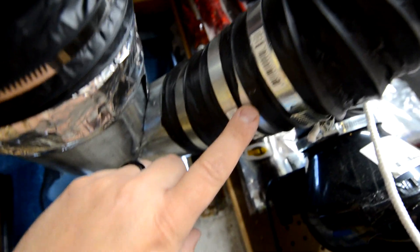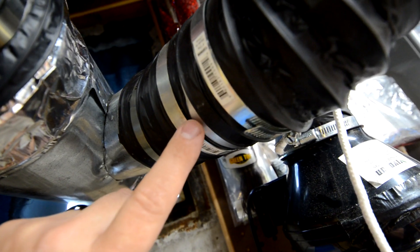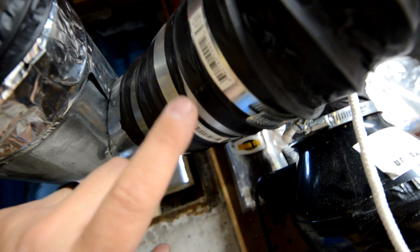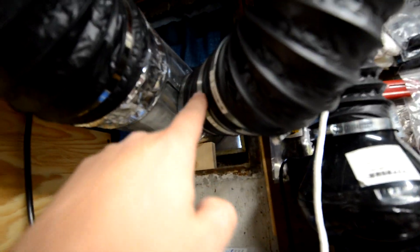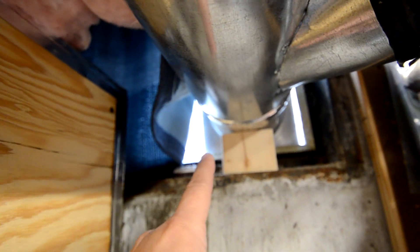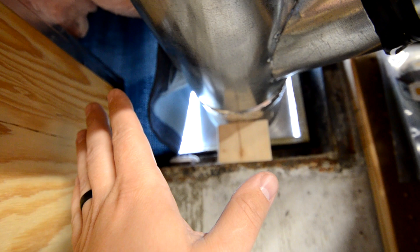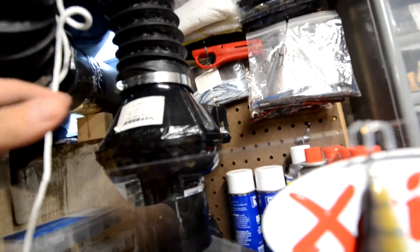In between here, there are two clamps, and the guy in the middle is basically like a check valve. The air goes up the tube, through it, and there's a plate inside that pushes it open so it goes out. I also have that vented outside. That is a basement window that used to be glass — I took the glass out, put a piece of plexiglass in it, cut a hole, and put the vent right outside, so it goes directly outside the house into the open air. I'm not breathing in any lead chemicals at all.